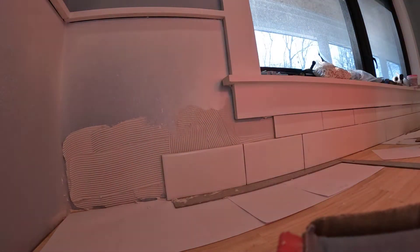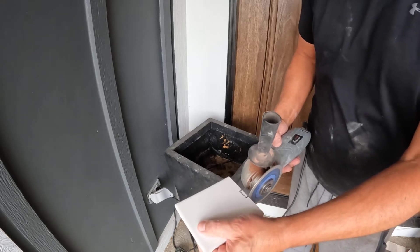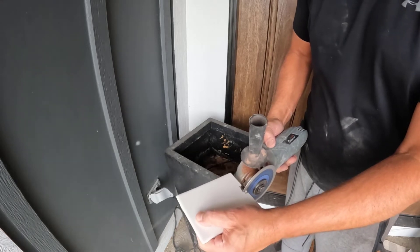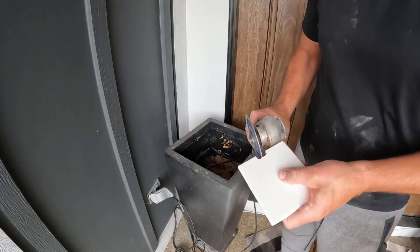The hard part is cutting around the window, and I had a receptacle on the other side too, which slows you down a little. But once I get through that small section it's pretty simple. For small cuts I like to use a hand grinder with a diamond-plated disc — it works great on tile for taking notches out. Remember, you don't have to be perfect here because a lot of it gets grouted in and imperfections won't show.